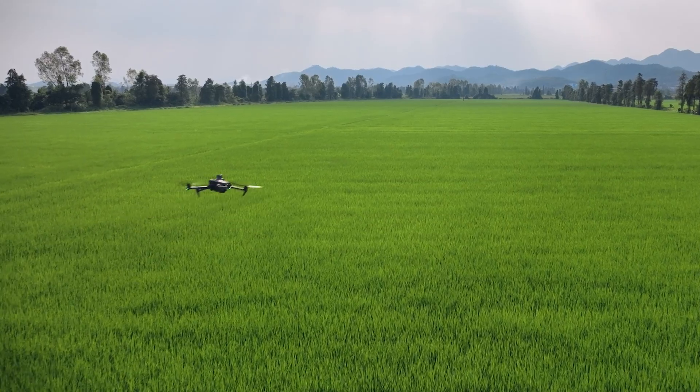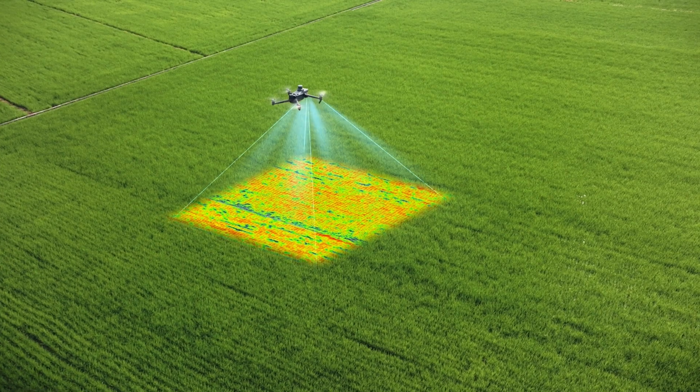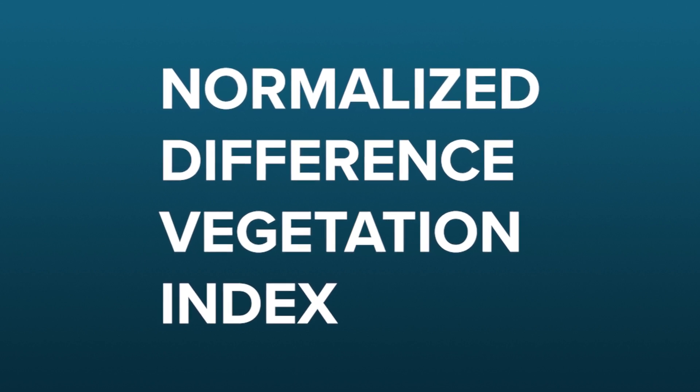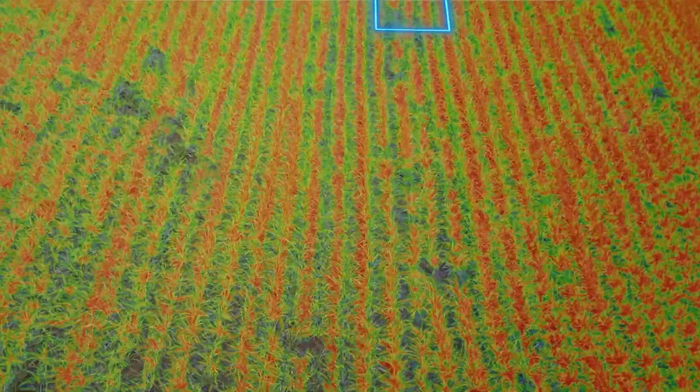The whole process starts with the DJI Mavic 3 Multispectral. This is what you'll use to get a more complete idea of what's going on with your crops. With four different multispectral cameras, it'll provide you with an imaging method called NDVI, or the Normalized Difference Vegetation Index. NDVI measures the reflected electromagnetic light waves from plants and the surrounding soil. Using NDVI, you can see things like seasonal variations, vegetation density, and even plant health. You can also monitor the state of the soil, like its water content and surface temperature. Simply map out your field, create a flight plan, and let the Mavic 3 Multispectral scan your land. For greater accuracy, you can pair the drone with DJI's RTK base station for centimeter-level accuracy.